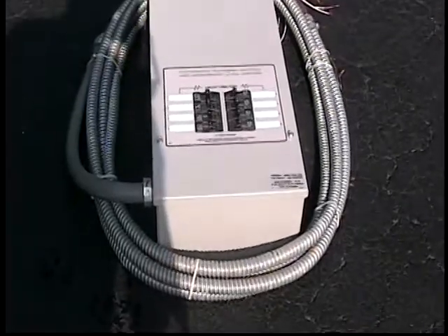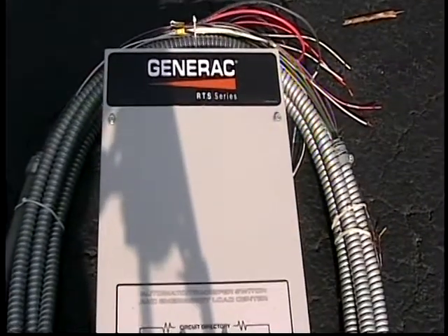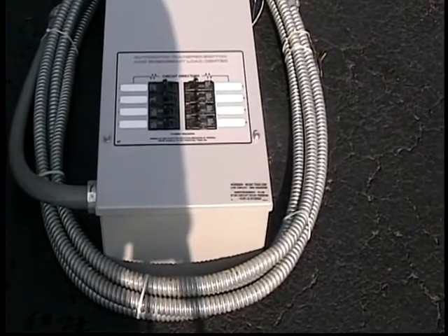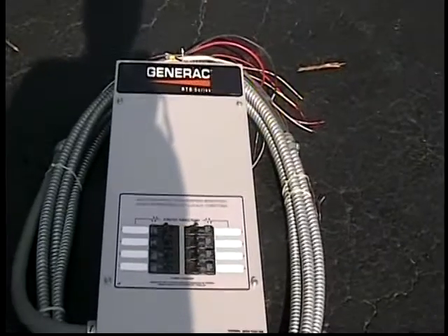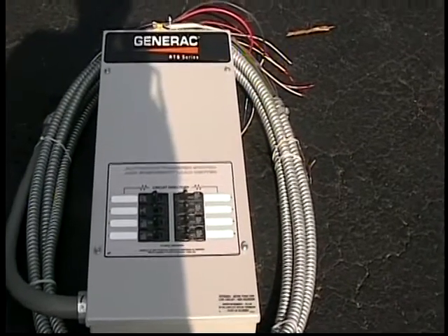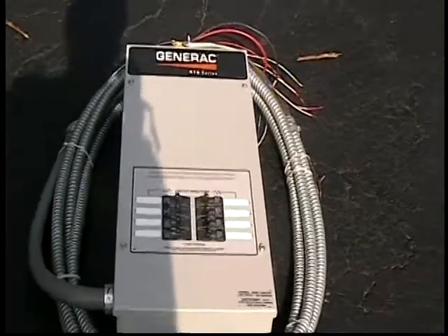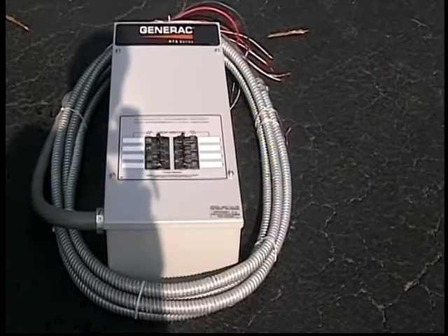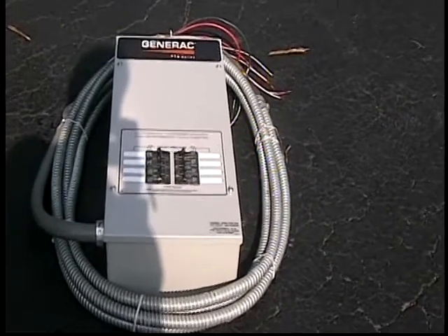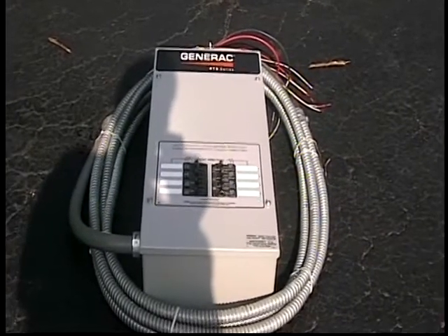This is what they refer to as an essential circuits transfer switch. This one I don't believe is available anymore — I purchased a few just before they discontinued them because to me it was probably one of the finest transfer switches I've seen. This demo unit is an eight-circuit; the one I put in the house is a ten-circuit, and you can get them up to sixteen circuits. I paired the equipment with what I needed: the generator, a disconnect on the back of the house, and a transfer switch. Because the generator only provides 50 amps and this house has a 200-amp panel, I wanted a ten-circuit transfer switch.